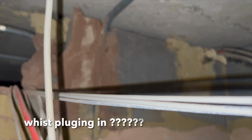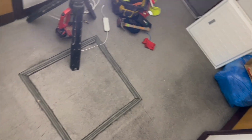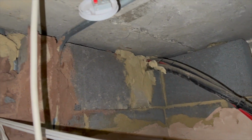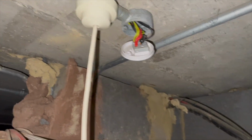Yeah. And it's just a permanent feed, so it charges the battery. So the emergency light down there, where we've got them panels, is just like a torch. When you see the green light, it means the light's charging. Then on the power cut, it illuminates. And it's supposed to illuminate for 3 hours until people can escape the building. And that's all the green LED does, it just indicates that the batteries are charging. Some of the branded ones even have flashing lights to give you warnings, but no one ever reads the instructions to know what it's all about.